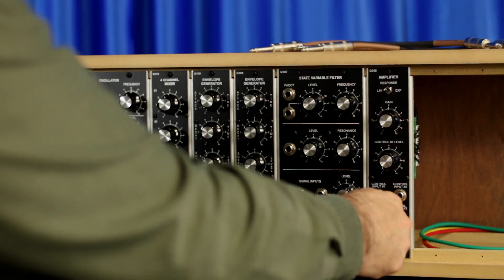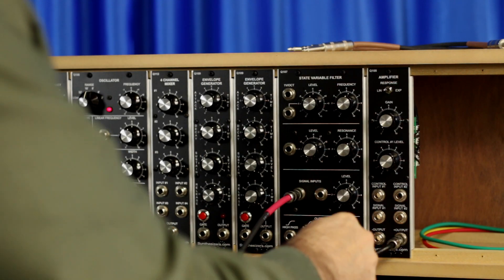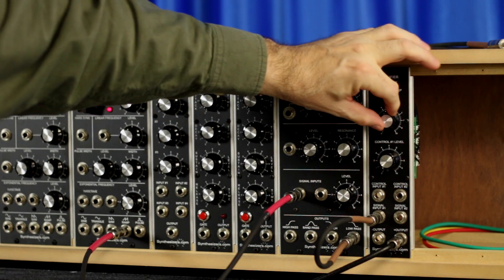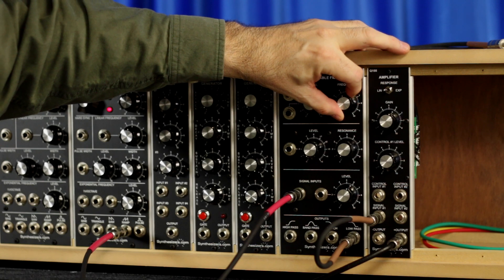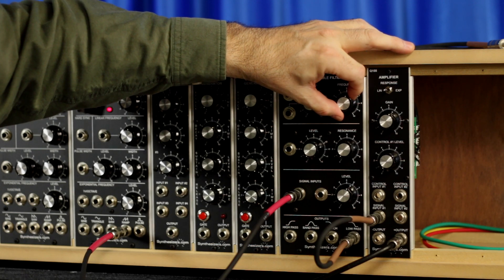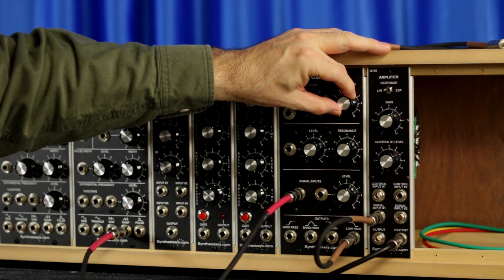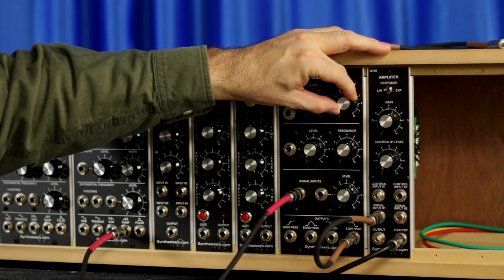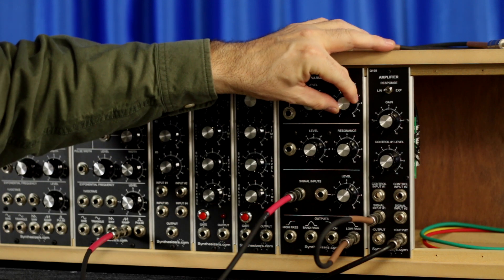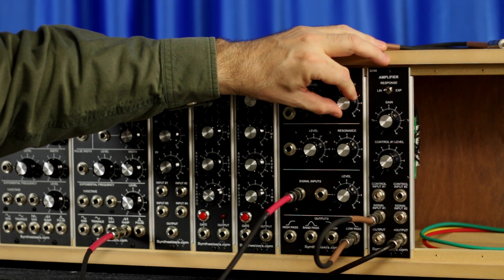What I'm going to do here is we're going to change and add the filter into the circuit. I'll put it in here, and then I've got to take the output of the filter and put it into the amplifier. And we should have sound now — there it is. Here's the effect of adjusting the filter: highest frequency, and then rolled it off at the bottom. And then the resonance filter is kind of the wow part of analog synthesizers — you can hear it going up through the harmonics. And that's the filter.